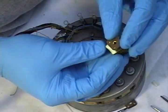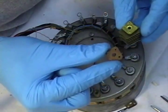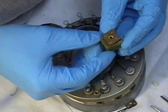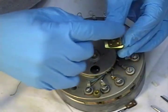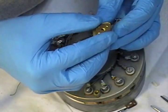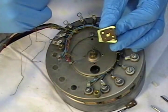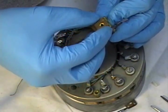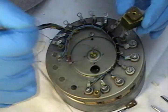One more little detail. These spacers are not square, they're rectangular. And you can put them on so that the holes don't line up properly. You can see there the spacer is square with the base. Look at this, if you rotate it 90 degrees, the pins will lock into place, but you can see that it is no longer square. You want to make sure that spacer is put on properly so that it's square. Otherwise, these will not line up properly when you assemble them.